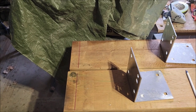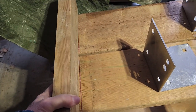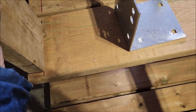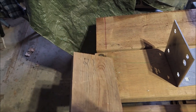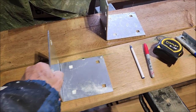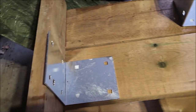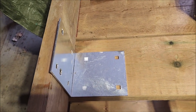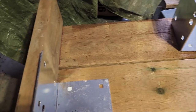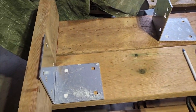It's a nice day in the garage — it's 5 Celsius, early in February. I'm just starting to lay out the dock. I started with a couple of lines where the 16-foot beams will be connecting in, and I'm just using this old chunk of scrap just for lining things up. Next thing I'll be doing is drilling some holes for these brackets, and I'll be placing them lower down on the 12-foot 2 by 8, because I want to have a bit of room up here for a 2 by 2 to go along as a nailing strip for when I put the decking boards on.